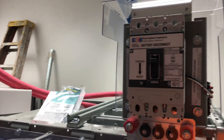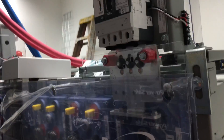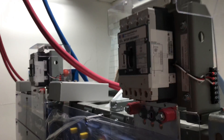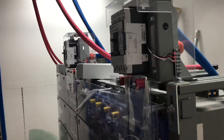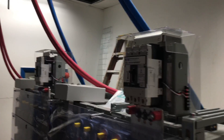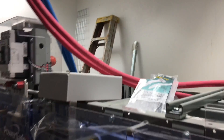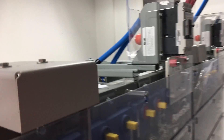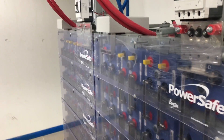What I like about this installation: they're having a breaker on the positive side and on the negative side of each bank, so if you have to do any maintenance on any one of these banks, there will be no mistake in shutting off the breaker as to which bank is off. You'll be working on the same bank that you closed your breaker on — that is nice. I've never seen four battery banks in one space like this, with such a small footprint, because of the form factor of these batteries.